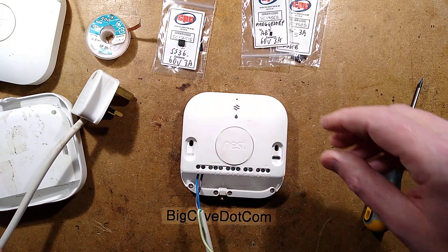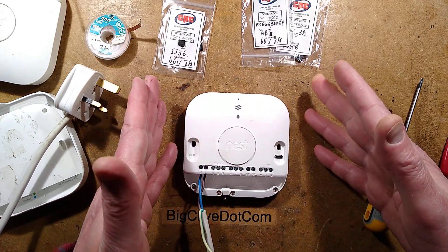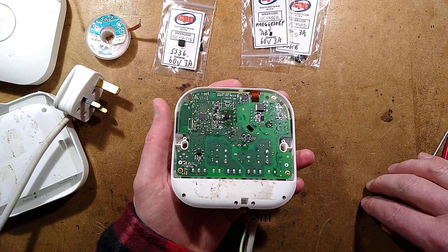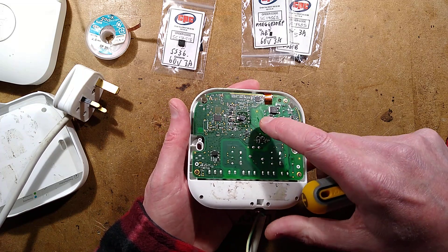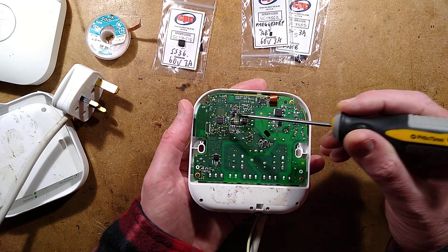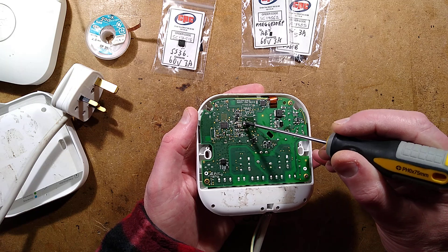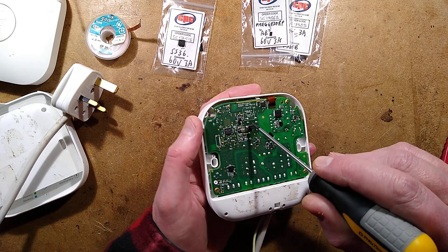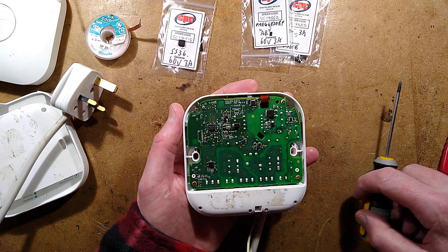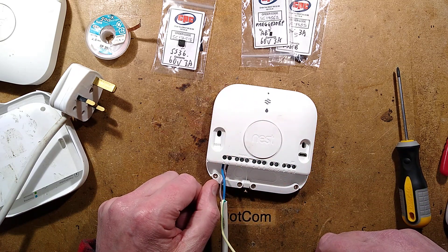I'm not sure if that's the ideal diode for this — it's got a slightly lower voltage rating than the previous one, but it is supposed to be exposed to around 12 volts. It is the 3-amp version, although the tiny size always makes me squirm. The band on the diode is pointing towards the big chip over there — also towards the hardest pad to solder. I should clean that flux off. I'm going to put this back together and that will be it fixed.